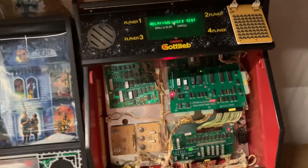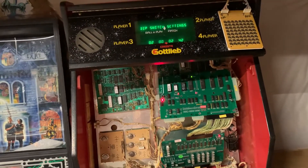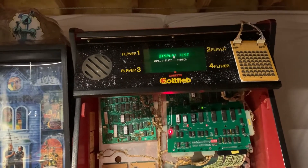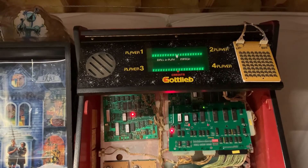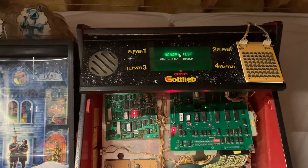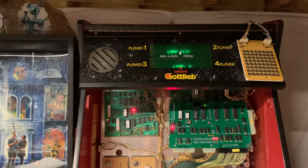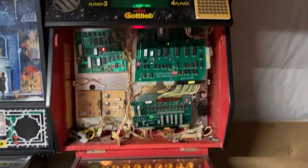You could hear or see something with each one of those coils. I'm going to skip the switch matrix test. DIP switch settings are correct. The display test does work — zeros, pluses, X's, and commas. The memory test will come up okay and it tells me the second ROM is 1DCA checksum. Then we're back to lamp test, so we are all functioning again.